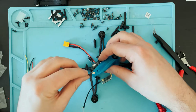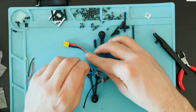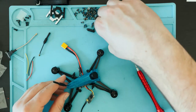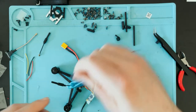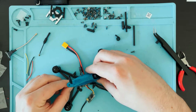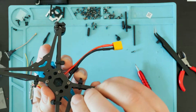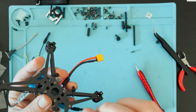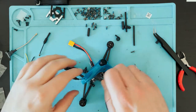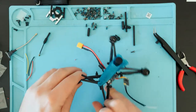All right, so now we'll take our antenna. We're gonna put the UFL connector part through this big hole right here. So what I'm gonna do is take this big standoff, because of one big standoff, we're gonna screw that in to the back here, and that's gonna help prop this up. Take one of these screws, put it in that hole, get the standoff on. There's that.